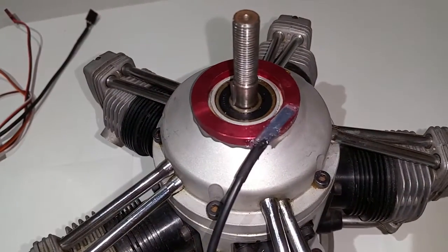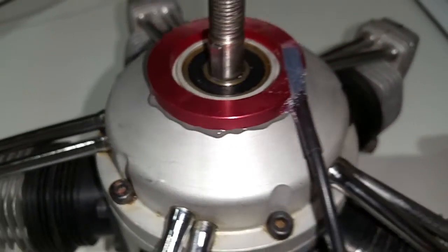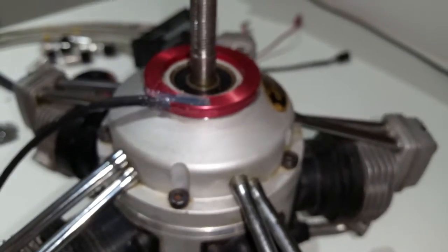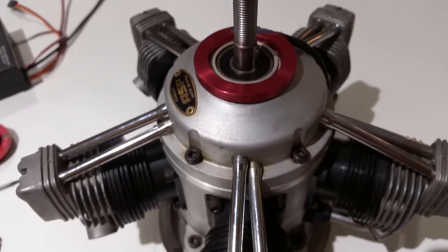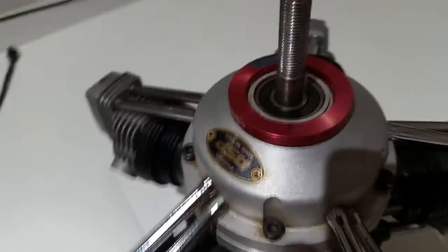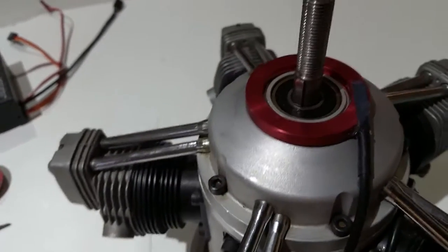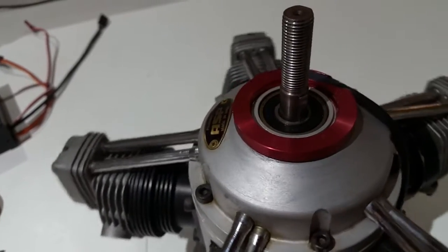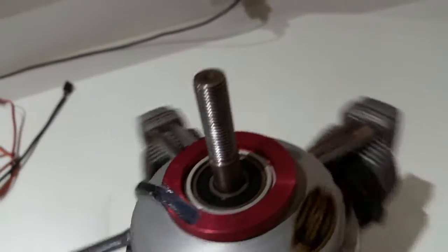I pressed the ring down — as you can see it squished out quite a bit, so that's why I said don't put too much. On this side I dressed it up a little bit with some paper towel and cleaned it up. You can do a better job, but I'll continue to clean it. A little bit of emery cloth will take care of any shadows if you really want, but you let it set probably until the next day to make sure everything settles.